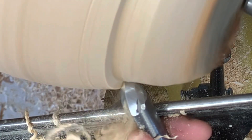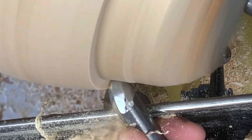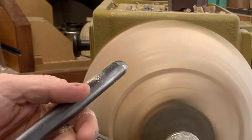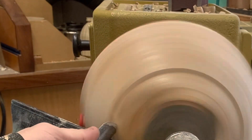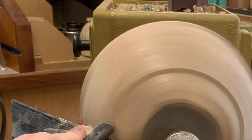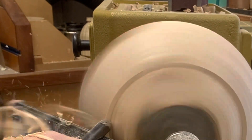This is a normal bowl gouge with swept-back wings. You can see the tip is riding the bevel and the side is peeling the excess. It doesn't matter if I open or close the gouge — I'm still riding on that bevel. This is a 40/40 grind bowl gouge. I'm riding the bevel on the tip; the side wing may not be riding the bevel but it is cutting side grain. For a smooth finish it's the tip you're worried about.